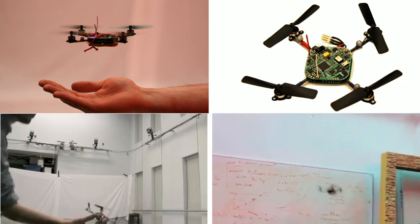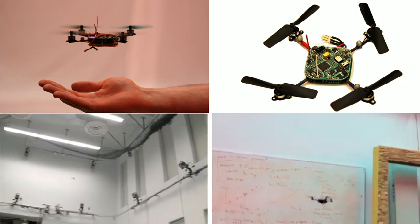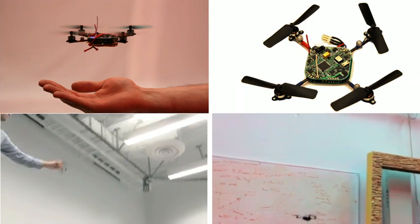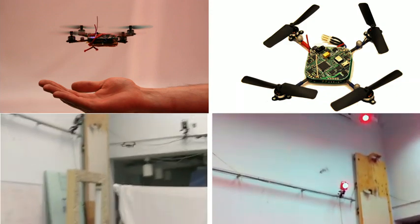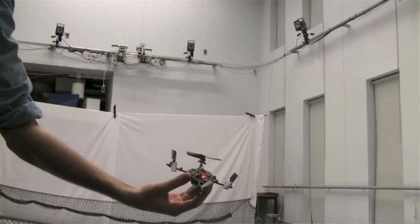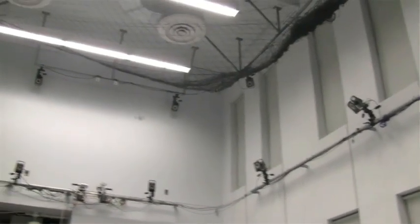This should be clear in these videos. On the bottom right, you see a robot performing a 360-degree flip in less than half a second. Multiple flips take a little more time. The processors on board are getting feedback from accelerometers and gyros and calculating commands at 600 times a second to stabilize this robot. On the left, you see Daniel throwing this robot up into the air, showing how robust the control is — no matter how you throw it, the robot recovers and comes back to him.